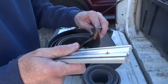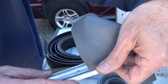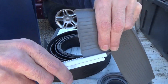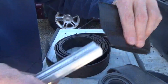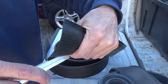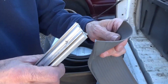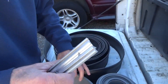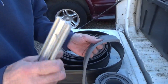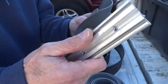The weather strip has to fit into the retainer — this piece at the bottom of the door. The strip fits into the groove and slides in. The smaller one can slide in but it's loose and could easily come out, so you want to get the right piece. Wood garage doors have a different type; this is for steel garage doors. On some doors the retainer and weather strip are attached together so you have to replace the whole retainer and vinyl piece, but on many you can just replace the weather strip since the retainer is attached to the bottom of the door.